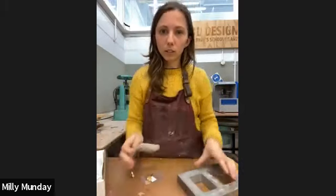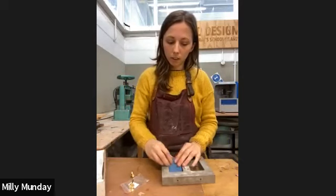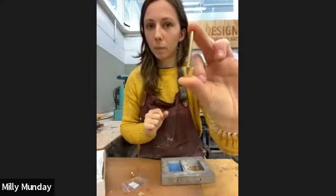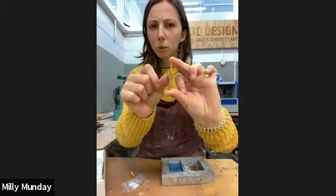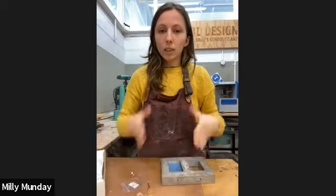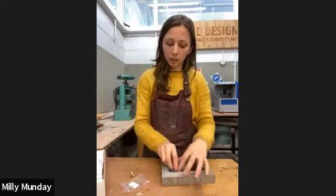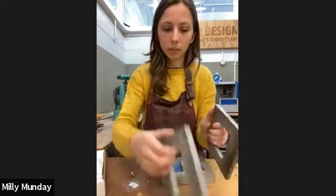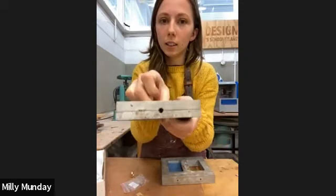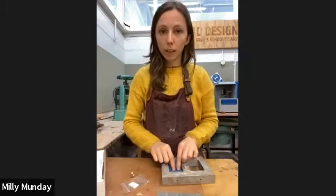You would unpeel them and you would lay them in. So we do one, two, three, stuck together. Then you have this handy tool, a sprue former. So it's got a nice funnel to it, which is where the wax injection nozzle goes in. And then the sprue's already there. So I would pop that in place. Some of the molds have like a hole, so that when you're putting that in place, it stays completely central. You'd pop that in, you'd pop your model in place.